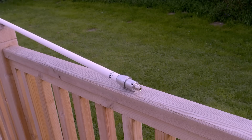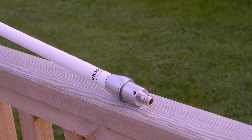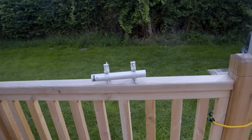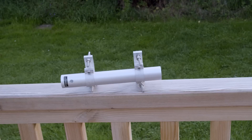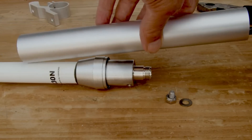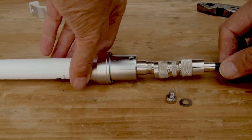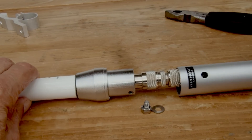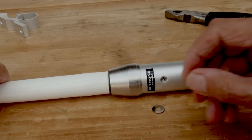The model I'm using is the N-type version, but you can also get the PL version fitted with the SO-239 socket. The mast support system comprises a collar, and you feed the coax through this collar to the base of the antenna — once attached, you've got a waterproof connection. You first need to pass the coax feeder through the alloy mounting tube, then attach the connector to the antenna. This also acts as a weather protector — slide it up to the antenna and fasten it with the bolt provided.